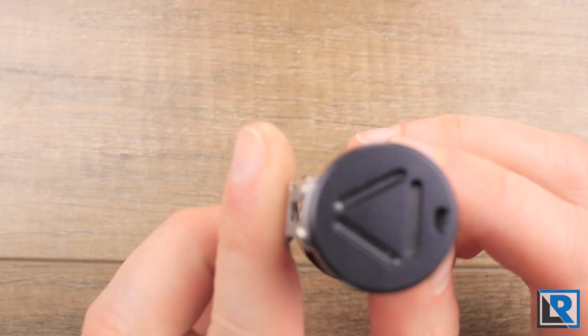The body section and tail are all one piece. On the body you've got some nice knurling — not really sharp, just enough for grip and style. There are two flats milled into the light on either side for branding and serial numbers. The rotary control ring has milled areas for extra grip, and the detent is fairly strong on both ends. From off to 100% is about 150–160 degrees of rotation. The control ring is a little bit mushy and takes decent effort to rotate.